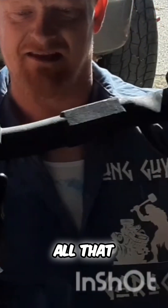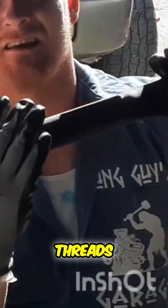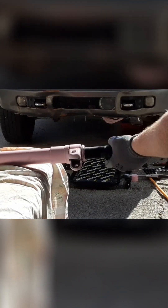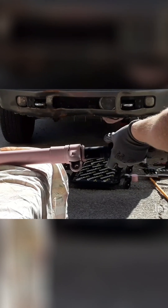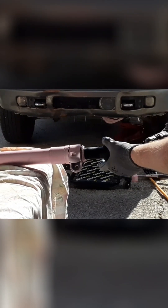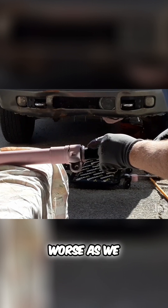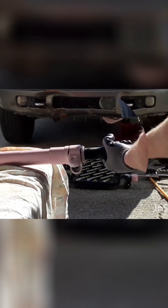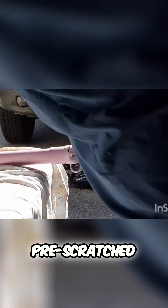You can feel and see all that jerky, jittery stuff — that's these threads, because they're all banged up. You can feel how it gets worse as we come to these threads. So I pre-scratched a reference mark in.